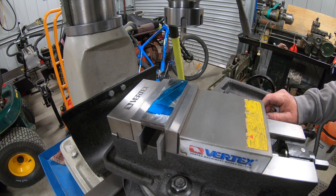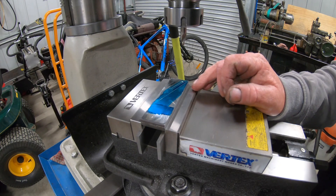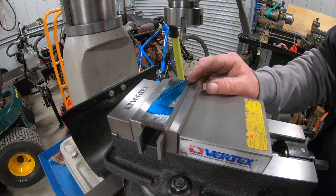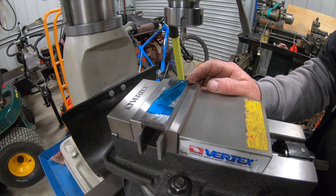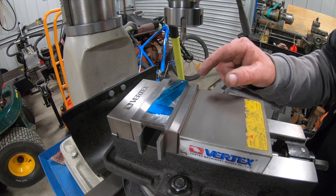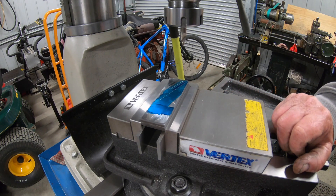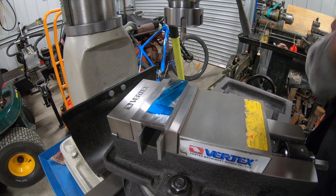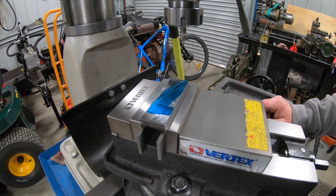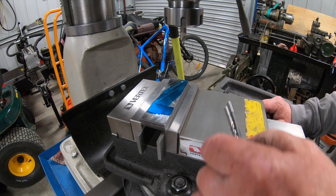I think I'm right to do this slot. I've got the swivel base on the vice, I've got it set to 20 degrees. What I did was I marked it out on the material and then I put a pointer in the quill and ran backwards and forwards and just kept tapping the vice around. I didn't want to rely on the graduations on the swivel base, but I reckon I've got it pretty much smack on.